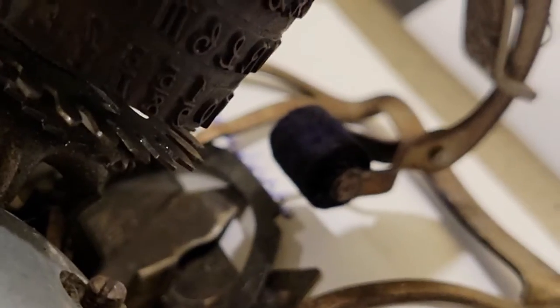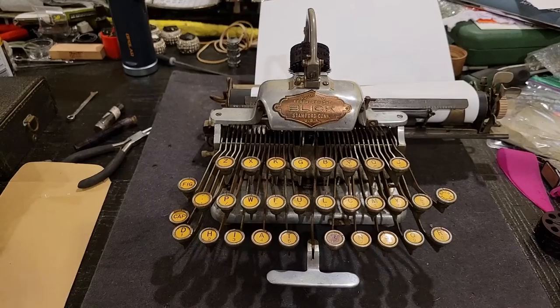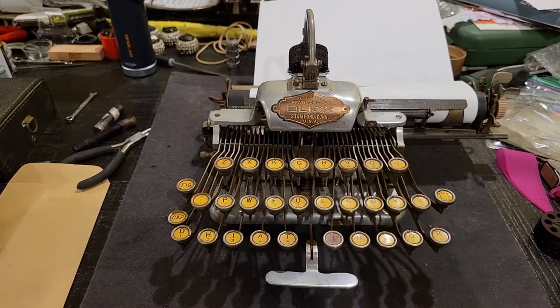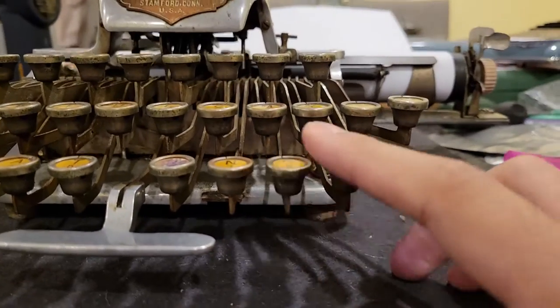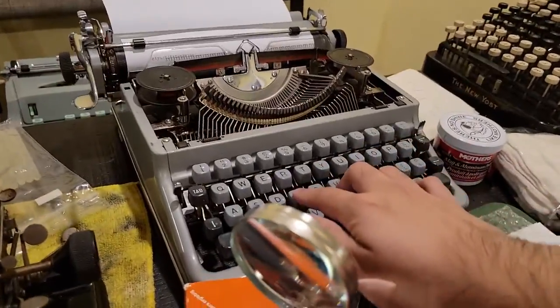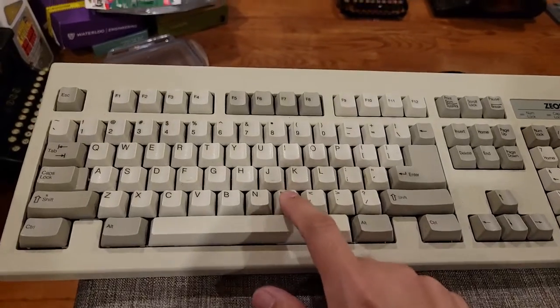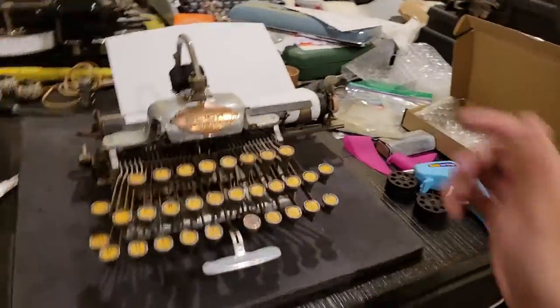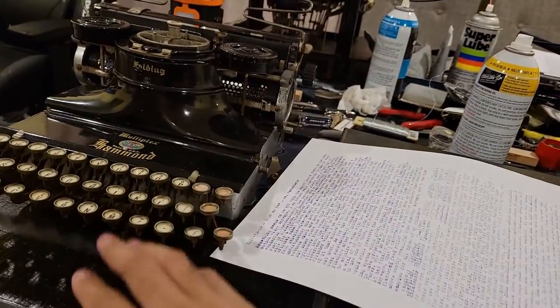And you can see that we're producing text in a nice script typeface. So given that, you basically just type. Of course, the main thing that would differ from using any other typewriter would be your technique. Compared to other typebar typewriters, the keys, as you can see, move down almost 3 centimeters, which is the deepest I know of any typewriter, whereas most machines go between 1.5 to 2 centimeters when you press a key, which is of course already quite high compared to the 3.6 to 4 millimeters of most mechanical keyboards or rubber dome keyboards. Now, this Hammond, which I'll cover in a future video, does have about 1 centimeter travel, but that's because the action of the machine is aided by the mainspring, which stores the energy for both making the impressions and moving the carriage along.